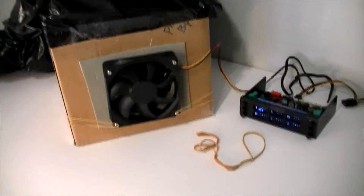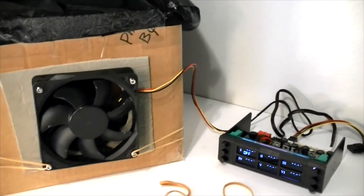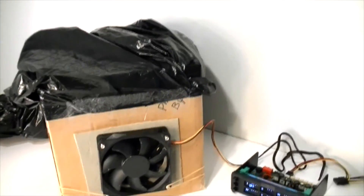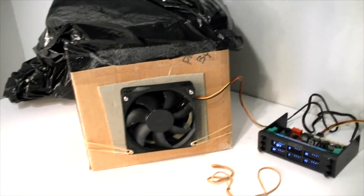The question is, what is this fan testing method going to prove? It's going to prove a couple of things. First, by measuring how long it takes the fan to fill the bag, we can get a measure of flow. And that flow is going to be restricted by the artificial restriction I placed inside the box.